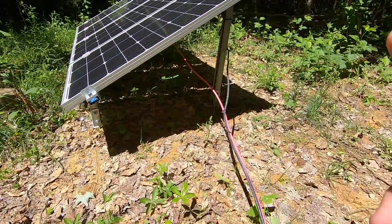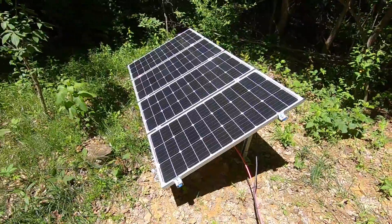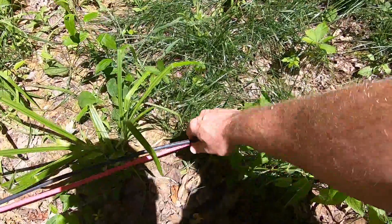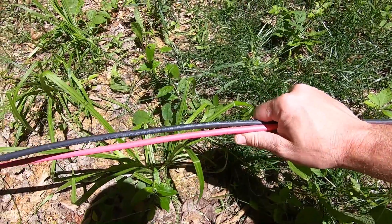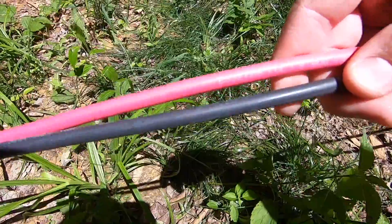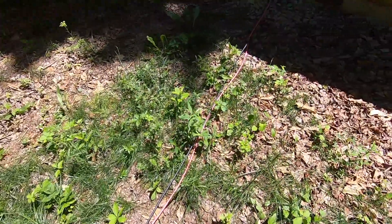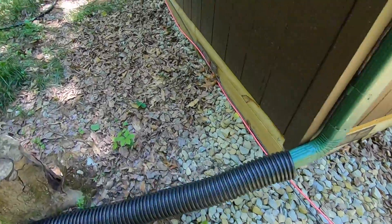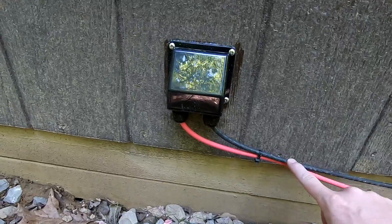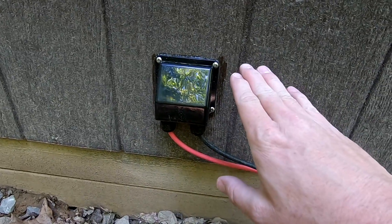I have a little bit more money in the stands — it was easier to buy a galvanized metal structure than build something. The wiring was a little expensive; this is outdoor-rated, sun-resistant, direct-bury cable so I can bury it if I want. It's meant for solar panels and it's eight-gauge cable, because the longer the run of wire the bigger gauge you need, especially with DC. It runs along the ground to the back of the cabin where I have a little termination block that keeps water and bugs out.